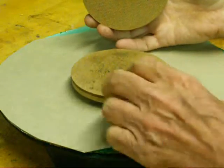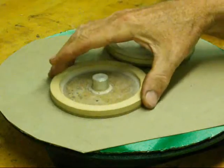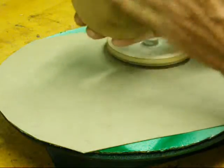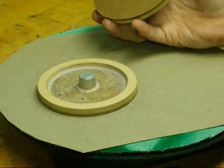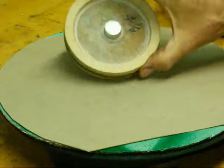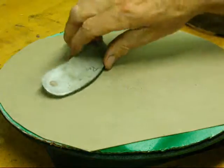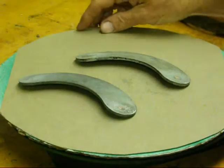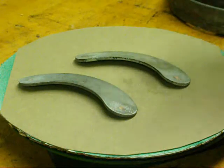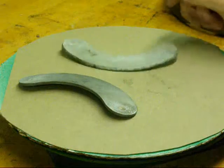Now this is a flat back pattern here. It's a split pattern, a two-piece pattern, but nevertheless it's flat — this is a flat plane, and so is the other half, and then of course they go together like that. This is just a little four-inch wheel. Now an irregular parting line would be something like this, where we have a curve, or if there's an offset or a step — something like that is said to be an irregular parting line.